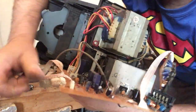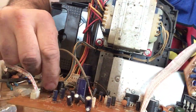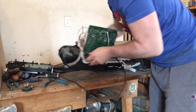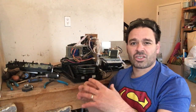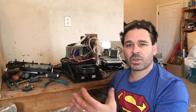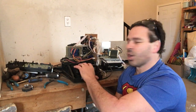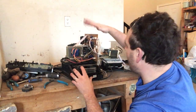Given the age of this circuit board, especially if you are into micro scrapping, there are going to be items on here that are potentially worth your while. These ceramic capacitors — these little orange guys right here — the older they are, the more likely chance of precious metals. My rule, or a rule that I've researched, is when you take those off, if you put a magnet to them and they are non-magnetic, they are going to potentially have more precious metal. The ones that are magnetic are not going to have the precious metal.